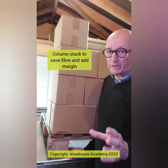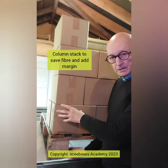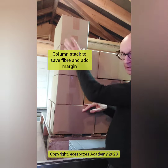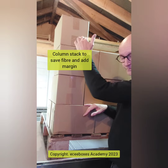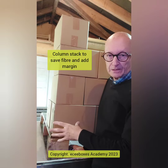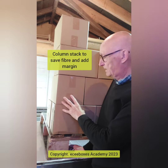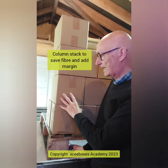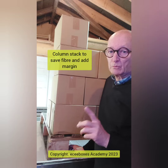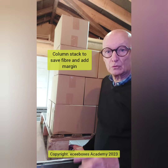It's a few pounds per thousand, but it's still a few pounds per thousand. Then you get the client to actually column stack — as I've mentioned before — apart from the locking layers further up the pallet. That way, you know they're going to do the job because you've calculated the box compression. And if they're not getting any returns or damage and things are arriving in good condition brick stacked, there's an opportunity to take fibre out. So that's just one other point and one little tip to bear in mind when you're doing an audit.